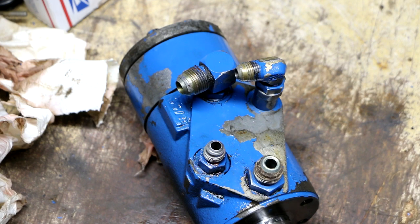But the other thing I did last night was I printed out the PDF manual that I found on the Parker Hydraulics website, which is the Hydra Guide HGA 10 manual. If you Google that, it'll come up right near the top. It's the Parker website. Parker and Ross and TRW are somehow all interconnected. But that is the official manual from the manufacturer on rebuilding these.